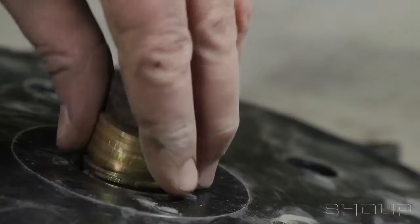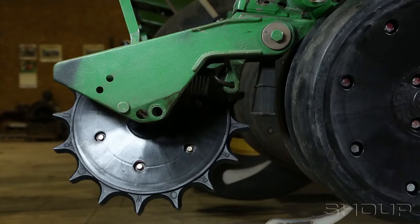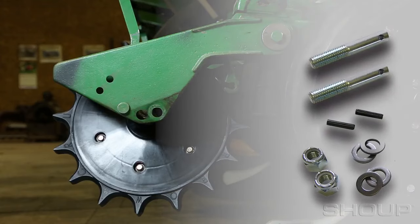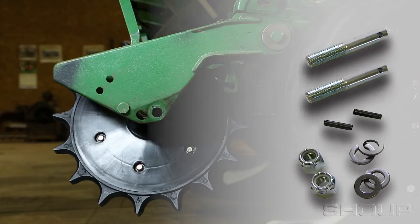It is important to use the provided spacers to shim the wheels one and a quarter inch at their closest point. It is not recommended to install the Furrow Cruiser wheels on planters with roll pin style closing wheels. Complete wheels for planters with roll pin style bearings come with an adapter stud which will allow the wheels to be shimmed properly.